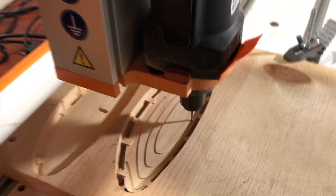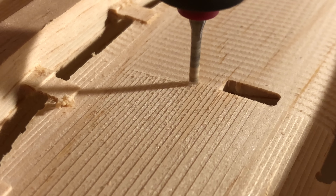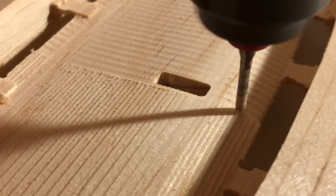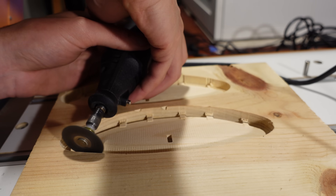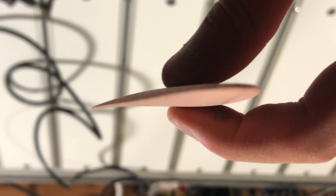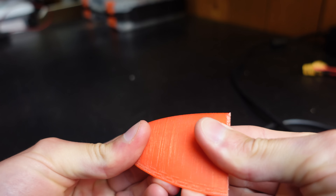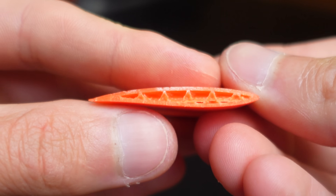This hydrofoil was the very first thing I made with my new Stepcraft M1000. I cut the whole thing with a 2mm end mill because my larger ones hadn't even arrived in the mail yet, so that took quite a while. I used tabs to hold it in the stock and cut those with a Dremel, then sanded it all down nice and smooth. I only ended up CNCing one of these hydrofoils, and I wanted to try 3D printing the other two. I was unsure of whether 3D printing would be accurate enough to maintain the precise airfoil shape, but upon splitting one in half we can see that it looks pretty good.